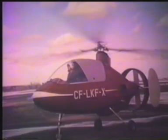This is our method of tracking, I don't know whether people do it these days. We just have this flag here and we put wax pencil on each of the blades, red, yellow, and blue, and some brave person sticks the flag into the rotor. And you do that with the rotor flat, you do it with the rotor tilted forward. What was that for? That's for tracking the rotor blades? That's for tracking. Oh, so they're all tracking in the same plane, so that the thing doesn't bounce around.